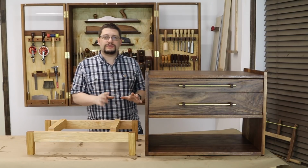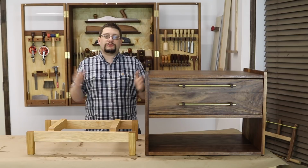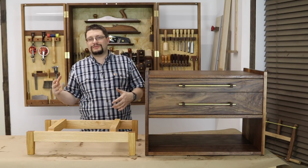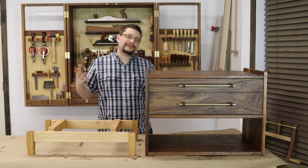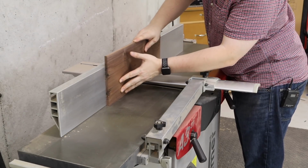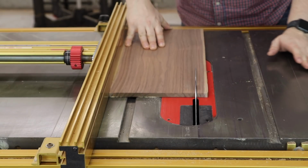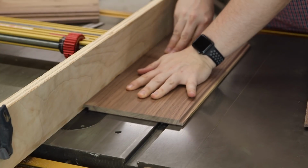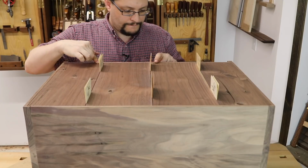So what I decided was a little bit different than making each one the exact same width. I said, okay, what's my width? And I said, all right, well, if I divide that by 4, that equals this plus all this extra room I need on each side of the shiplap. Like, all right, that's interesting. What if I did something else instead? And that was to make 2 panels that would be the exact same width in the center, with the other one slightly smaller on the right and the left. And that's what I ended up doing. And I think it's pretty cool. I think it works proportionally very well. It lays out really well, that is.